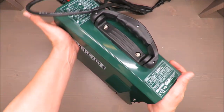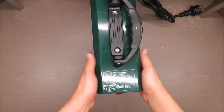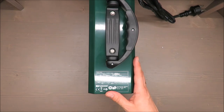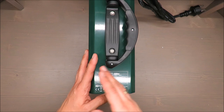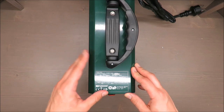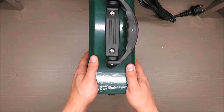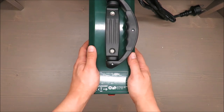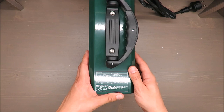The main details are on the top of the unit. Cutting current is from 15 to 40 amps. Cutting performance: copper up to 4mm, stainless steel up to 8mm, aluminum up to 8mm, iron up to 10mm, and sheet steel up to 12mm. Working pressure is 4 to 4.5 bar, and current is 230 volts — I didn't find information about compatibility with US voltage supply.